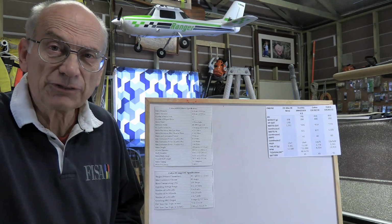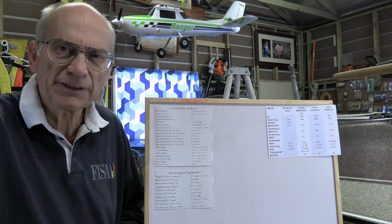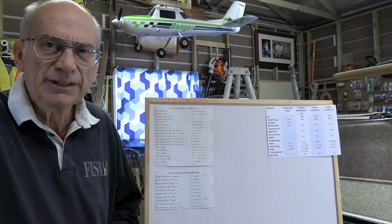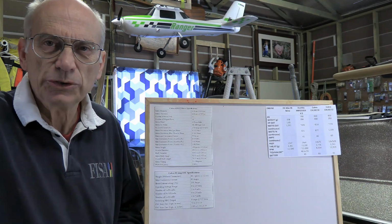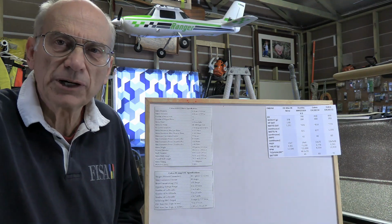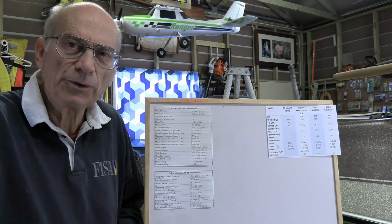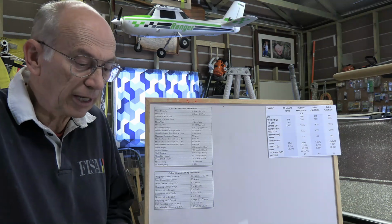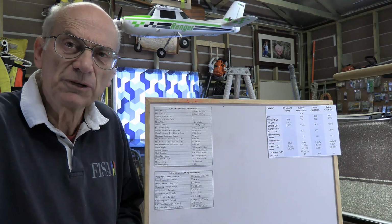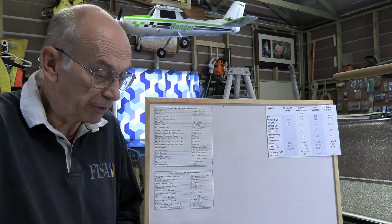Having said that about the active freewheeling, as I read various chat groups on the internet, people discussing the benefits of it don't seem to think it's a huge big deal. As far as the heat goes, it's happening when you're at partial throttles. The heat isn't that big of an issue at that time, and the amount of power lost by the current going through that diode doesn't seem to make a huge difference on the flight times, but obviously any benefit would be a good benefit.